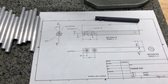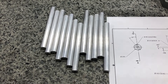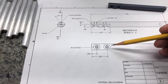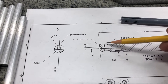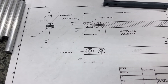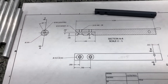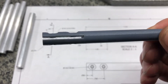Welcome back to the channel. In my last episode we made these just equal length 4-inch long 3/8 aluminum rods. In this episode we're going to complete all the mill work on them. So what we want to do is do these spot faces, through holes, tapped holes, the slot — we're going to slot this. One of the trickier parts is I need a hole at 30 degrees on the end relative to the rest of these holes. I'll show you how I'm going to do that. This is what it looks like — just a 3D printed version so you can see what we're shooting for.